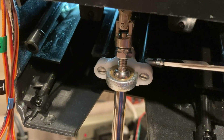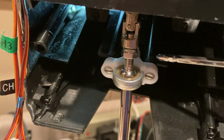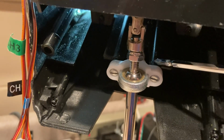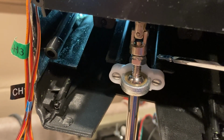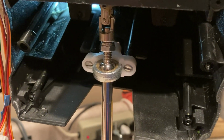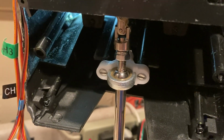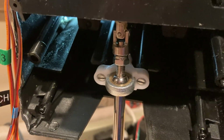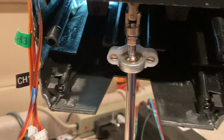So these broken off pieces were just like glorified standoff posts. That was the magic trick. You drill these bigger than that screw, you screw on in with a little bit longer screw, and you screw into the post farther. On this particular break, that's what was able to fix it, because it was lucky enough that the screw posts were long enough. Sometimes you don't have that option. Maybe your screw posts are a little shorter. You just have to address that a different way.